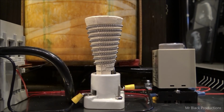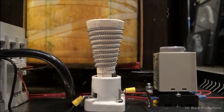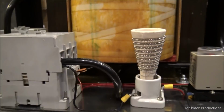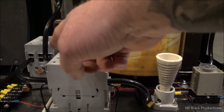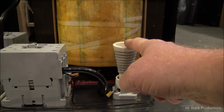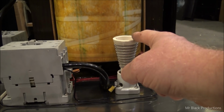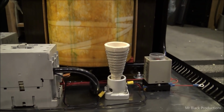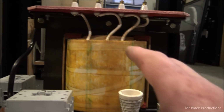We'll start right here. So I once did a video called "How a Soft Start Circuit Works in Any High Voltage Device." So your main principles of this are, you've got 2 contactors, this one here and this guy here. You're going to have a field of resistance, which here I'm using a conical Glo Coil, or otherwise a heating element, and a timer.